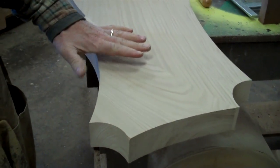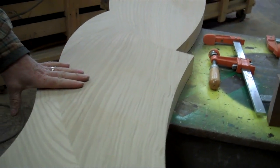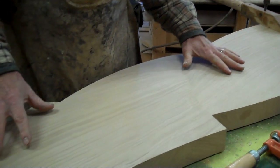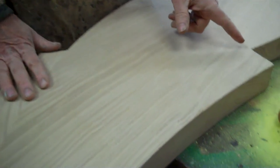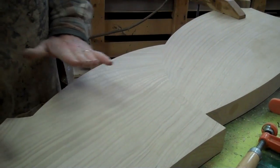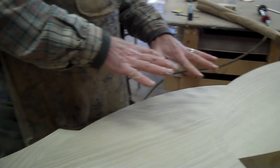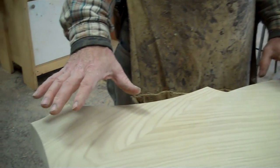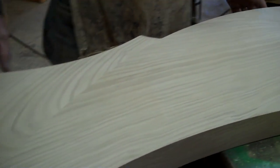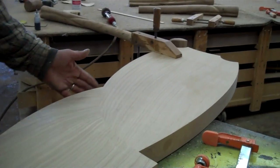The table is made from a wood called horse chestnut — it's a very coarse grain wood, as you can see here. I've glued this together with my curved glue joints, and I like the subtlety of that line. You can't feel any change, but there's an obvious change in how the grain works, which adds to the flow of the piece and the sculptural look.